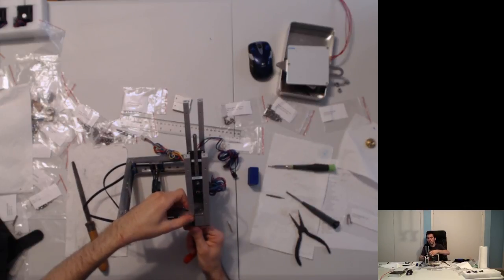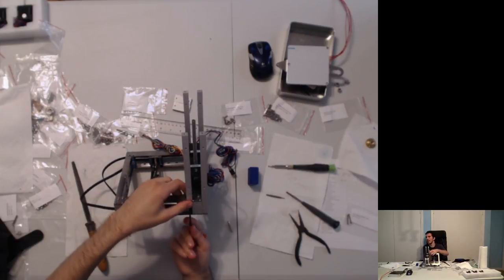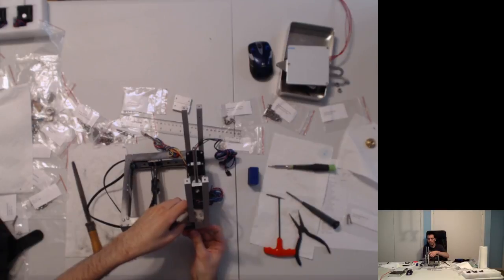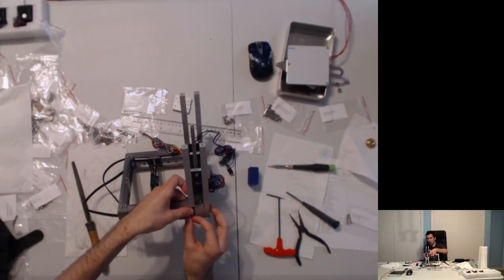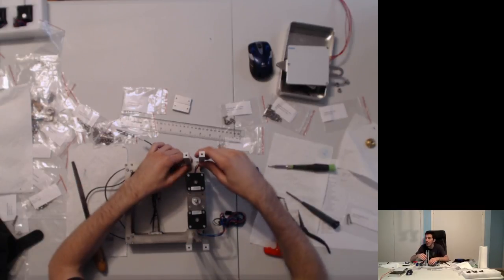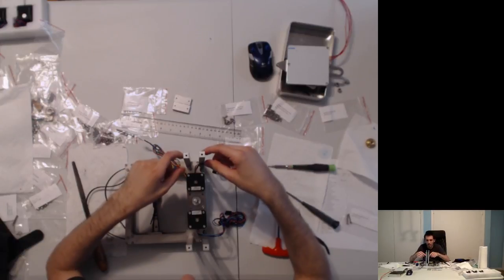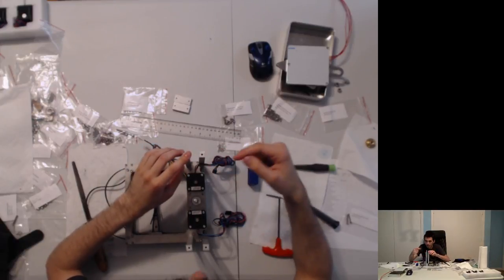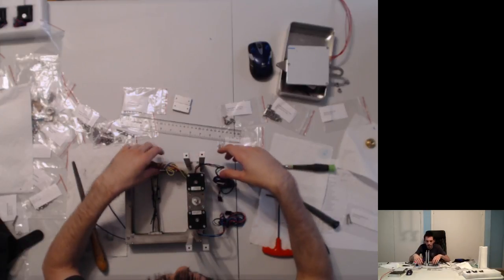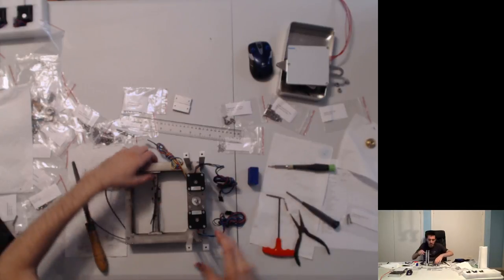These are actually Torx screws. So I can't tighten them very much with a normal Allen key. I have Torx bits, but I have to get through a very small hole here. So I'm going to need to find a proper way to do that. And one of the ways to do that is to put these plates on the side eventually, secure these beams in place, then come back, Loctite that screw into place, and yeah, still needs a way to tighten it, but we'll figure it out. Okay, so with the belts.